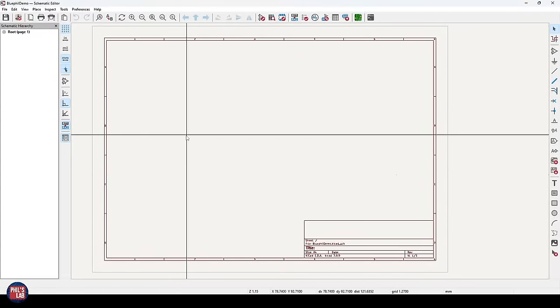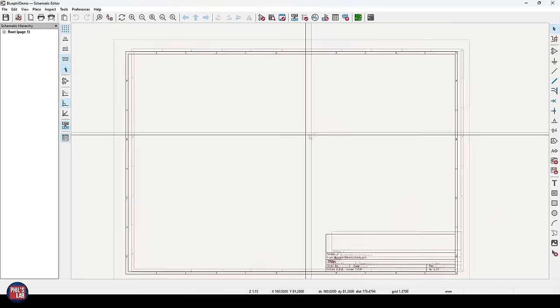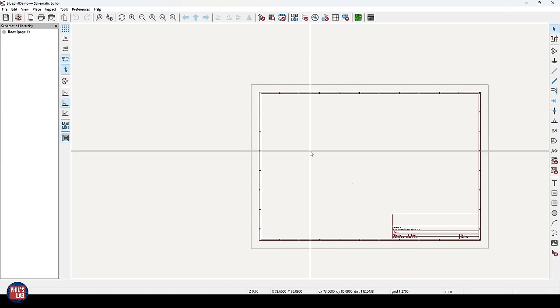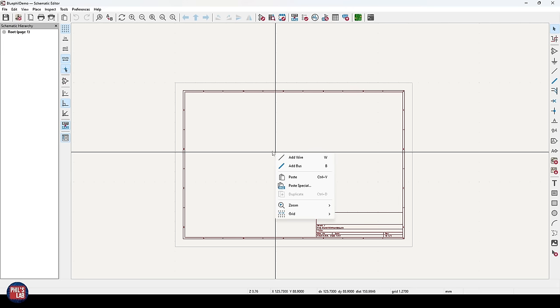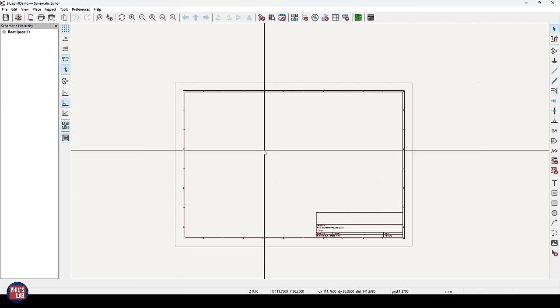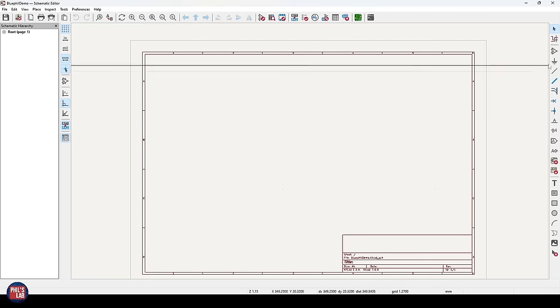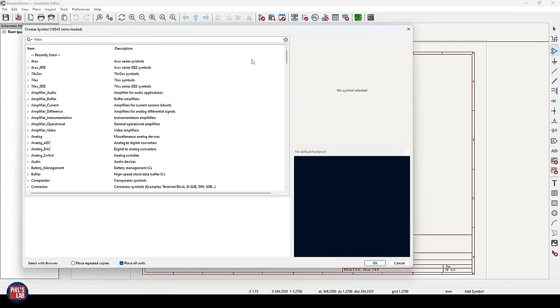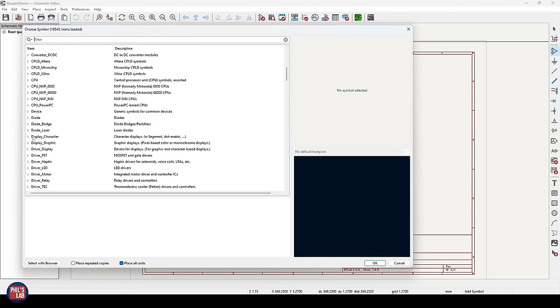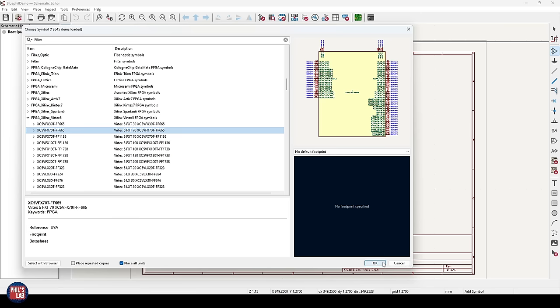The schematic editor greets us with a blank schematic page. Hold the middle mouse button to navigate, use the scroll wheel to zoom in and out, left click and drag to select, and right click to open a properties window. To add symbols, click the op amp symbol on the right toolbar or press A — KiCad contains a large library of pre-made components including ADCs, connectors, diodes, and resistors. Simply open a dropdown, select the part you want, click OK, and add it to the design.